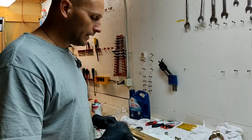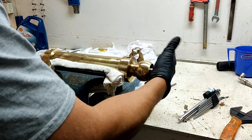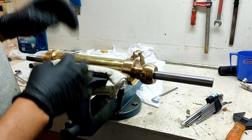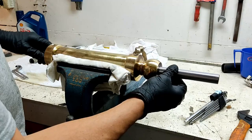And you'll see here, it's really, really easy for me to push the cylinder rod from side to side. That's a very good indication that the seals on the piston have gone hard and they're in the collapsed state and won't seal particularly well. And the lip seals in the ends are also in a similar state, so they're not actually clamping onto the rod very much. They've gone hard, and as evidence of it, lots of oil was leaking out of them.